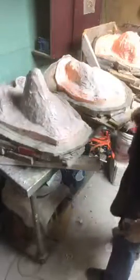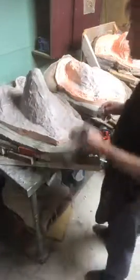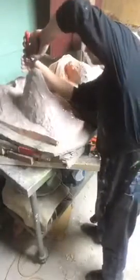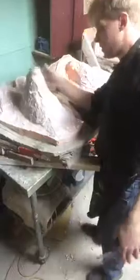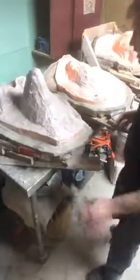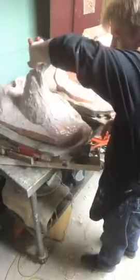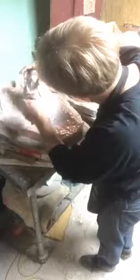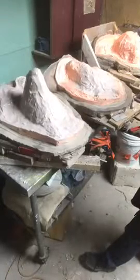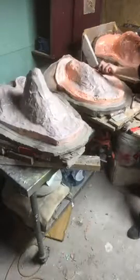Like if you're repairing a hole in a car, you use it, sand it all down, you fiberglass shell it, then you Bondo to beauty coat. In mold making, you beauty coat first and then Bondo the shell because you want the beauty side to be inwards. So I don't like that one. Honestly, I could go rip this Bondo off if I really didn't like it and start over because it's just against the silicone. It won't matter. There's a problem on this one I might as well do now.